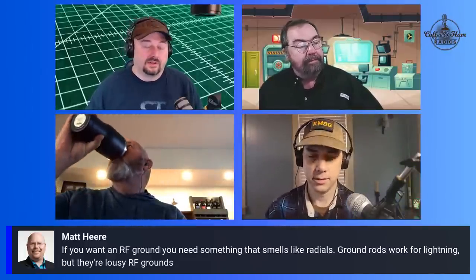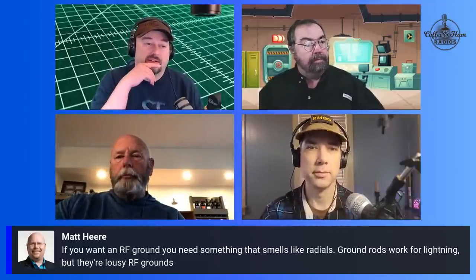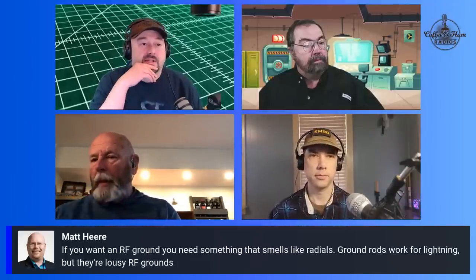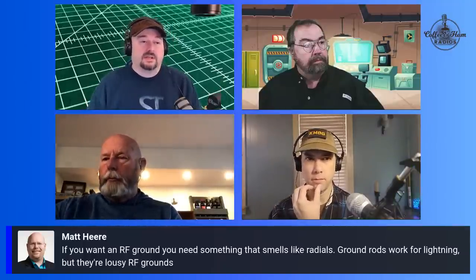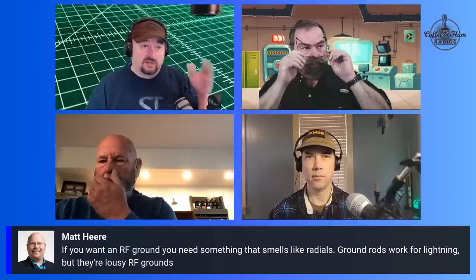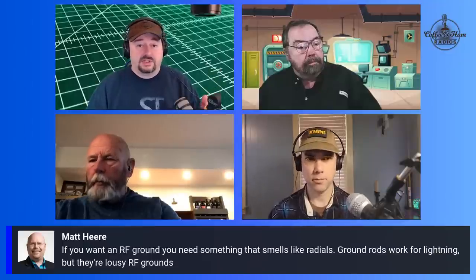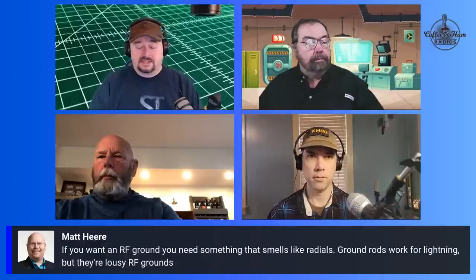Yeah, so they're all a little bit different. If you have a really nice ground rod that's hammered into the ground 8 feet and it's copper and all that, and the ground is actually good conductive ground, you're probably fine. But then some people put the ground rod in, and then they also put in a radial field. There are just different ways to do it. But when you have a lot of noise, a good way to work on getting rid of that noise is to go through that progression. Can you ground it? And if you can't, can you put a radial system in? If you can't, can you put a counterpoise in? And if you can't do that, can you ground it at the shack feed point or something? Or even as Don was saying, ground it inside the shack.